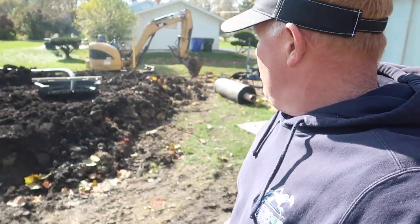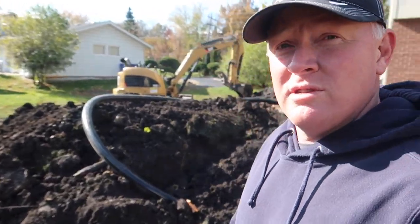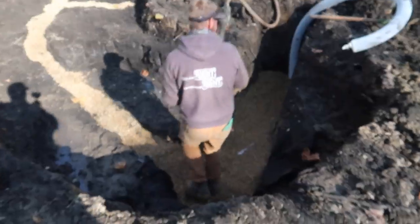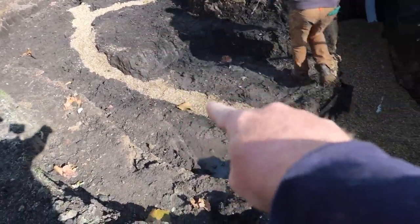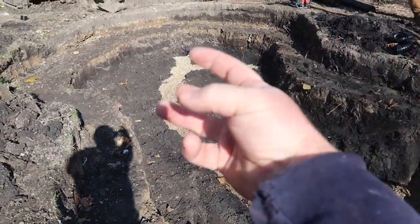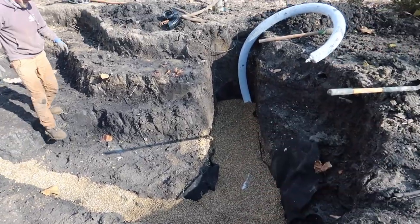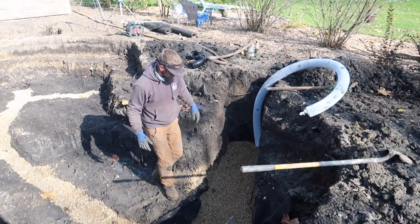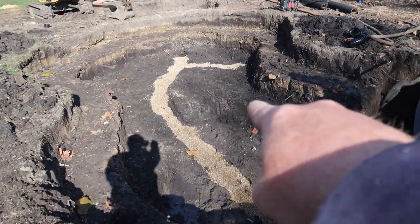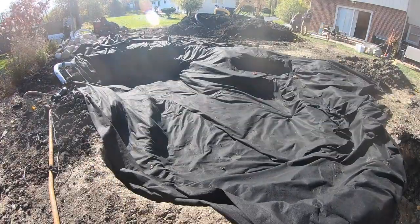Day two out here and we've got one extra guy with us — we've got Juan, myself, and Chris. We've got our French drain system almost finished underneath the liner. After we get that all buttoned up we'll get our fabric in and our liner. The goal today is to get a bunch of the big boulders that were delivered yesterday from out front back here and start rocking this pond in. You can see where we dug the trench — about a 10-inch deep trench through this area, all coming down to the lowest part of the pond with pea gravel so all that water can infiltrate through into a pipe that runs out. We left the sump pump down in here all night and it never shut off — otherwise this thing would have filled with water.